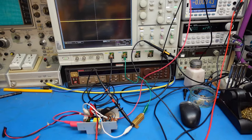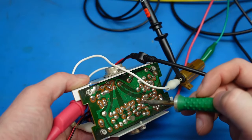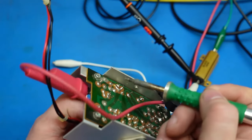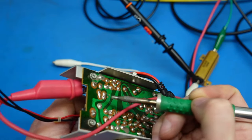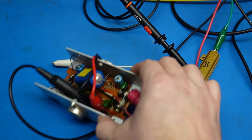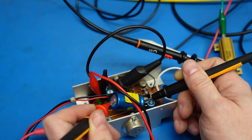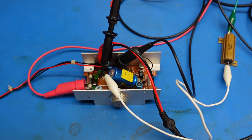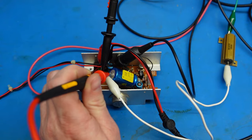I've got suspicions about that capacitor being leaky. I'll soon deal with that. There's a bit of residual voltage across it, which is probably understandable - very slowly discharging. It doesn't seem faulty. I've just rewired it. Not really made any changes, but with this disconnected it's not quite so horrific. In fact it's stabilised - offset is now half a volt and dropping steadily. Output's perfect, current's happy. I think this is okay.